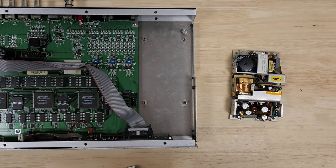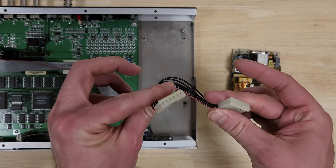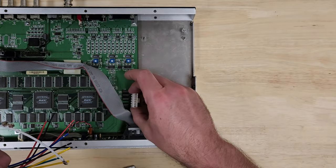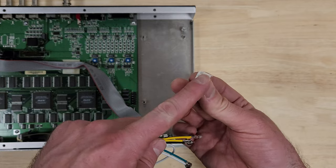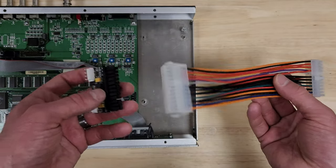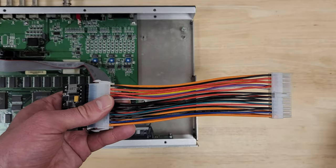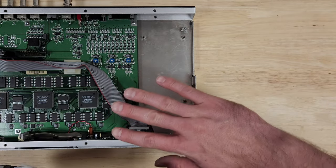Going back to the principle of being able to undo modifications - this is the original wire that connected the old power supply to the board. I don't want to alter it in any way in case I want to put it back. So I got a kit to make my own connector from Amazon. This will slide right into the six-pin header and I can clip in whatever wires I need. I also got an ATX extender so I can cut it in half and solder the wires I need onto my custom connector.